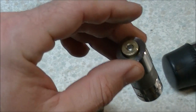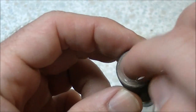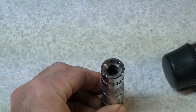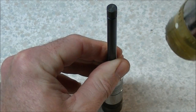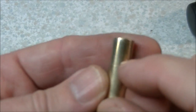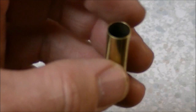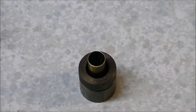The next thing is to drive the cartridge case all the way out of the die body. Take the decapping chamber and set it down with the knurled portion up so the big hole is there for the cartridge to fall out into. Invert the die body over it so the cartridge case can come out. Drop the knockout rod back in and give it a few taps with the hammer — that will drive the cartridge case free of the die body. That has basically resized the top portion of the cartridge case, and we've got our primer seated. With the cartridge case removed and primed, we're going to set it back in the decapping chamber and flare it to accept a cast bullet.